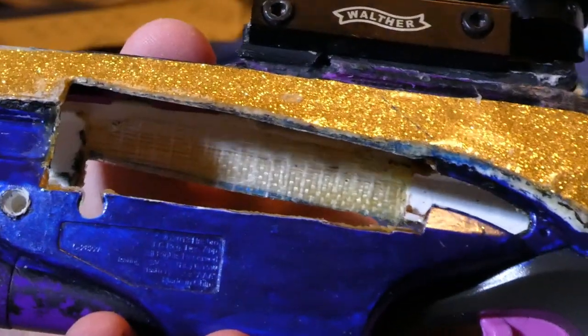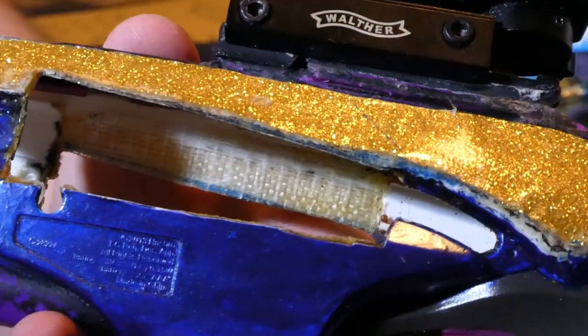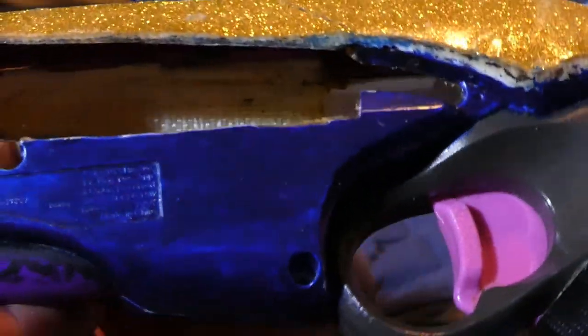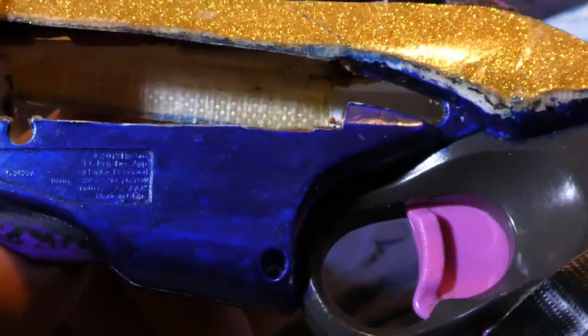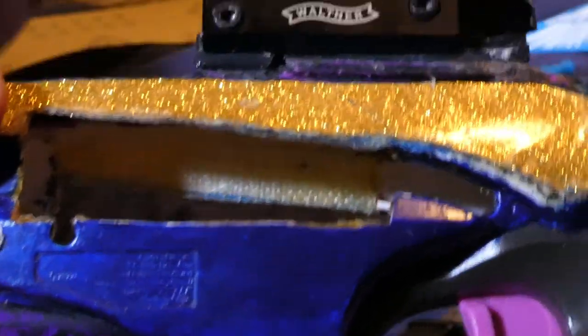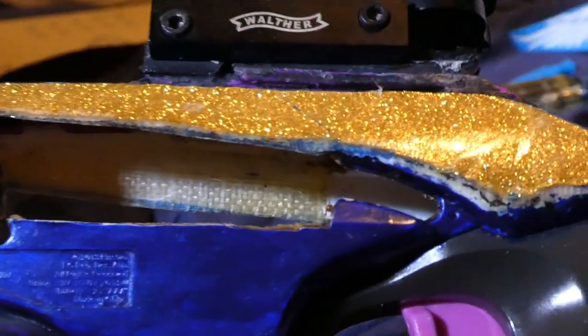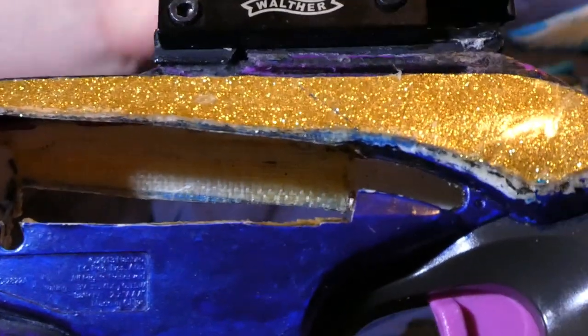Now, to bond the ABS epoxy, you need to have a layer of crazy glue and fiberglass, then two layers of epoxy and 7.5 ounces of fiberglass. But as you can see, that is woven fiberglass, just like you can make woven carbon. But I don't want to use woven carbon for this. Why? Because it's brittle. It's stiff.